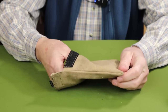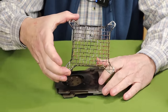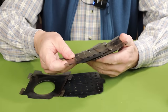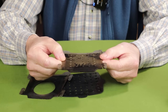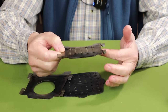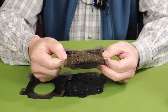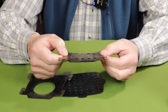Let's put it back together. We have the four side plates — three of them are identical; the fourth, with the feed port, is the only one slightly different. Here's the first thing I'll say: when I got this and put it together, the plates were perfectly flat. Now you can see they have a curvature to them — not warping, more of a set. It's actually taken its final shape in the first burn, and it played into my assembly of it the first time. When you get this for the very first time, you might struggle with it a tiny bit until after that first burn, and then it has that curvature set. They're all perfectly in the same shape and they fit together — and they're heavy too.